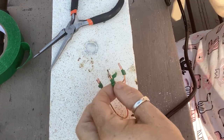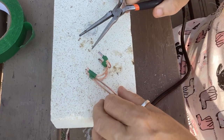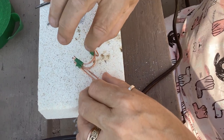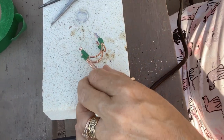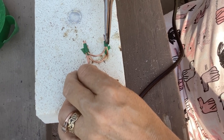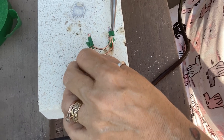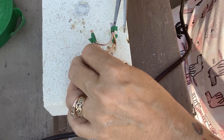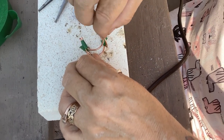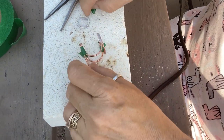I'm looking at all of the joints and trying to line it up. The front looks pretty good, so I'm going to take off the tape to show you what the joint actually looks like. If it's done properly the solder should just flow right up the entire two pieces of metal and give you a nice seal, which I feel like we really accomplished here.